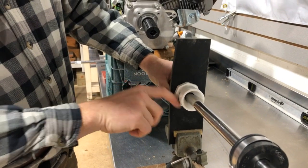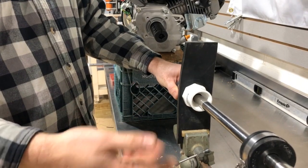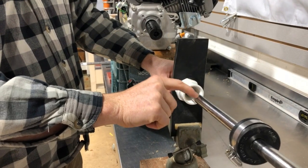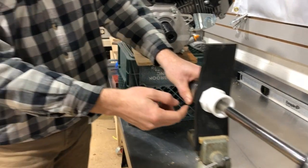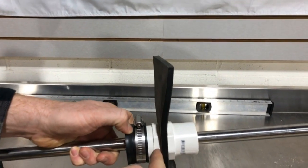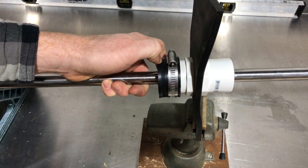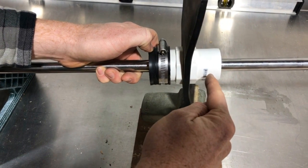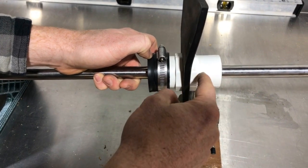And this guy here is a 1.5 by 3/4 bushing or reducer, whatever you want to call it, it's the same thing. So it adapts from that Fernco down to the shaft size from the motor. And then inside of here, on the side, you can see there's a plastic piece, your flexible membrane, another plastic piece, and then your Fernco. Inside of that is a 3/4 inch close steel pipe nipple, which allows me to thread, because there's threads on the 3/4 side of this white PVC, one into the other.